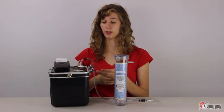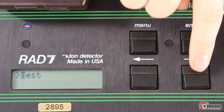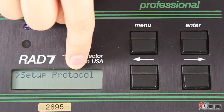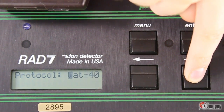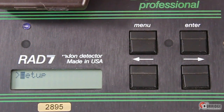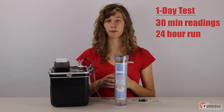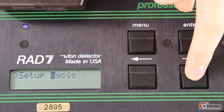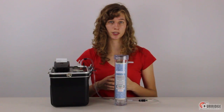To configure the Rad7 for the test, you need to select the one-day protocol using the menu and buttons. From Test, click the right arrow key twice to see Setup. Click Enter. The first option is the protocol option, so click Enter again. Now you can choose from among seven different options of pre-programmed testing protocols or customize your own. To run a one-day test, click One Day. This means that the Rad7 will take 30-minute readings for a 24-hour run — it will complete 48 half-hour cycles. You can configure other options under Setup, including Tone and Format. To learn more about Setup options, see pages 23–27 in your user manual.